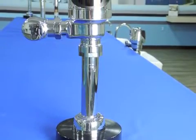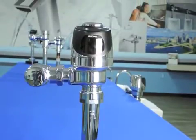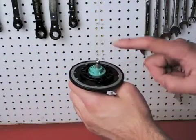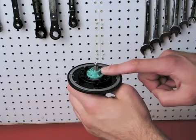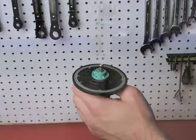If too much or too little water is running through your Sloan G2 flushometer, you probably have the wrong volume regulator installed. The volume regulator is the colored piece of plastic attached to the top of your diaphragm assembly. You need to match the correct volume regulator to the gallons per flush for your closet or urinal.